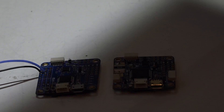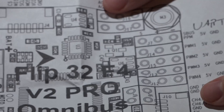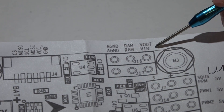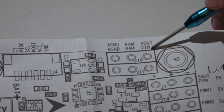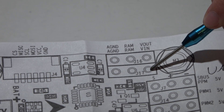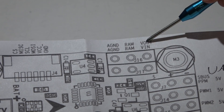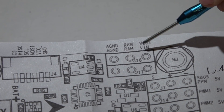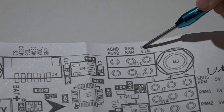For the F3 Pro and F4, I can't tell you off the top of my head which pin is video in and which is video out because they keep switching it up. But you should have gotten a wiring diagram when you purchased it — just look at the diagram to identify video in and video out. Whichever way it is, just know: video in is where your camera goes, video out is where your video transmitter goes.